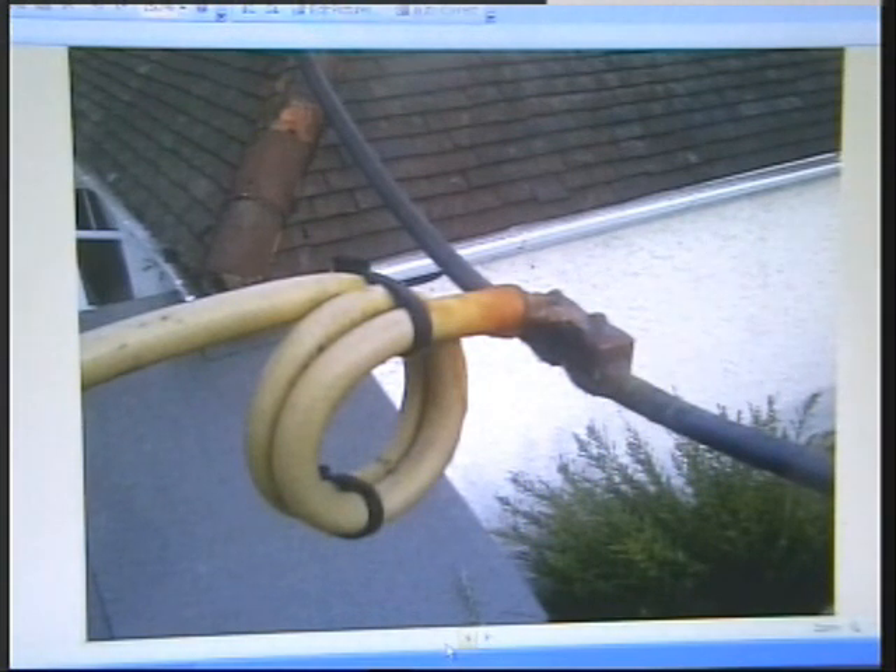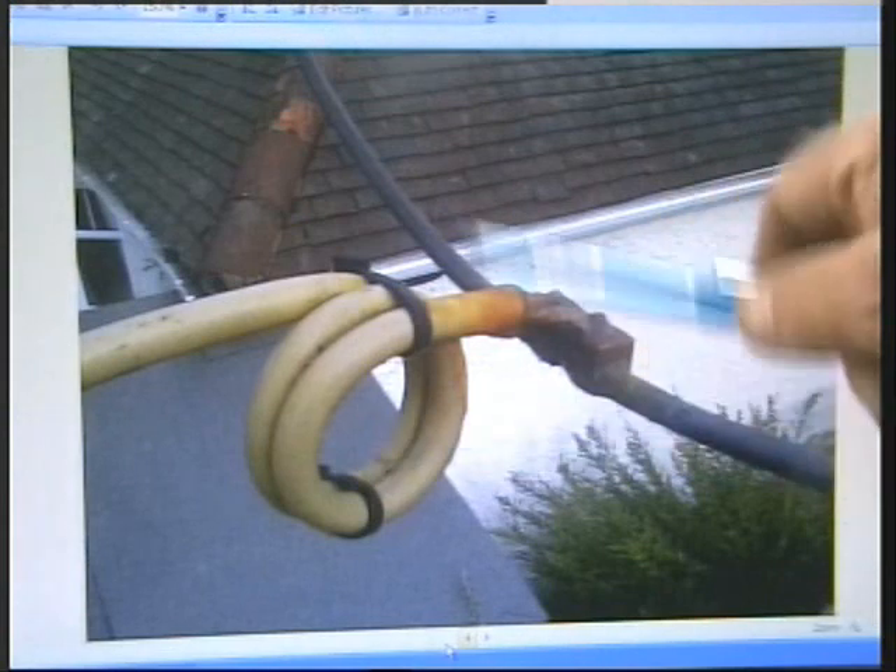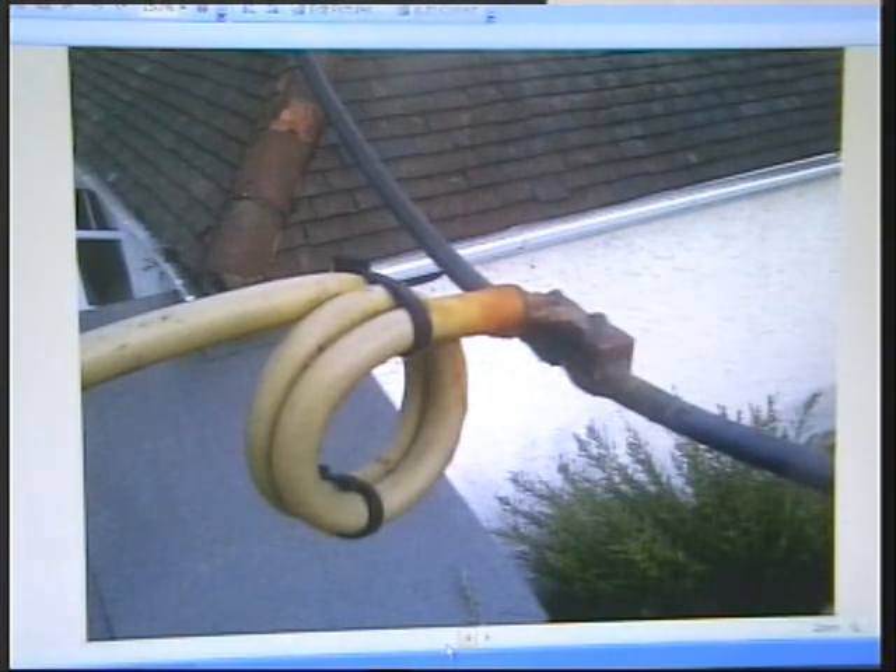I really love this stuff. It has good RF properties, and if it's painted a couple of times you really keep the water out of the coax, which is a big problem. Dampness and rain getting into the coax causes capillary action and it ruins all sorts of impedances. But this is pretty good — it's UV stable and has good RF properties. The overall performance of this aerial I'm most impressed with.